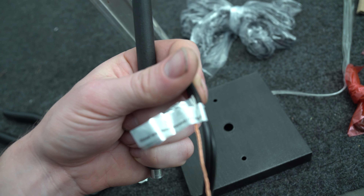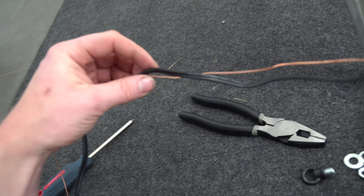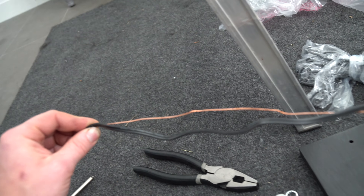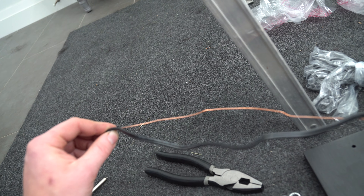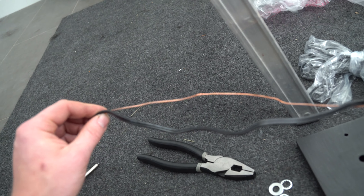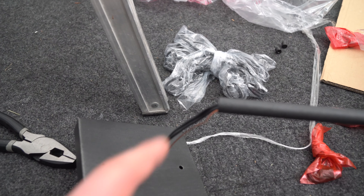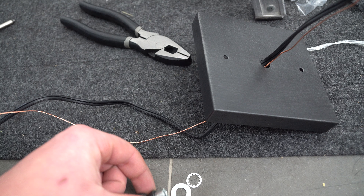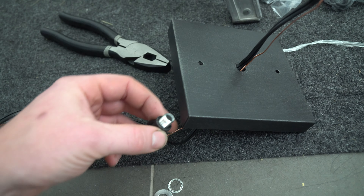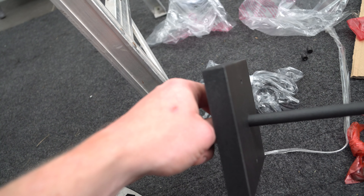If you want to do a chain mount, hold the light up, hook it off the chain, bend one of the links over, put it through the link and squeeze it back closed. Then remove the amount of chain you don't want. For me, I'm using just the bar — I loosen this connector, hold that end with needle-nose pliers, stick a rounded screwdriver through and twist. That loosens it up. Twist your tips together, and keep note: the smooth wire is the hot wire.